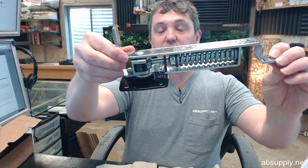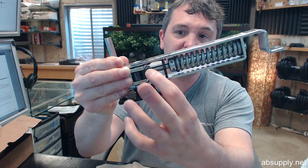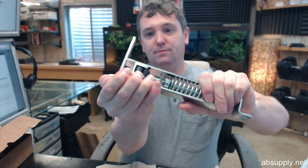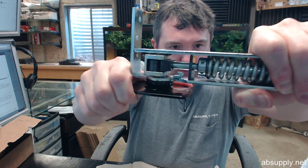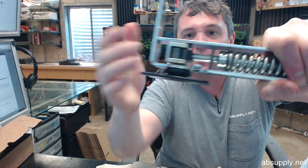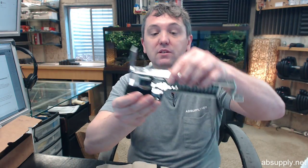Okay, let's take a visual tour of the items. Well, here's the business end. That is going to be the double-acting floor portion. You're going to have your spring. You're going to have this assembly here that is basically the shape of a bird's mouth, and then you've got these two rollers, and there's just too much tension on the spring to really demonstrate it. But as the door opens, those two rollers are going to force that bird's mouth portion to work like this, and then in the opposite direction as well. That action of the rollers pushing the bird's mouth piece will compress the spring, and that's how the double acting feature is going to work on this.